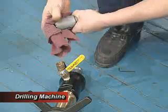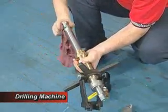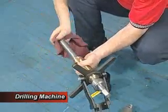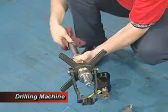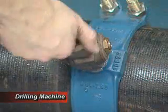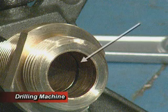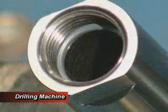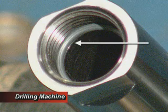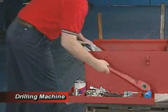After drilling is complete, clean and oil the machine surfaces. Lubricate the tool holding area of the boring bar with a lightweight oil such as WD-40. Protect threaded pieces by assembling them with their mating parts. Periodically inspect the boring bar's O-ring seals and replace them if they appear worn. There are two O-rings in the corporation adapter and one in the threaded body. Carefully place the tool back in the toolbox for storage.